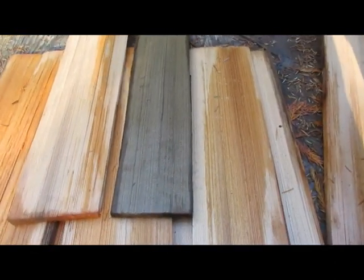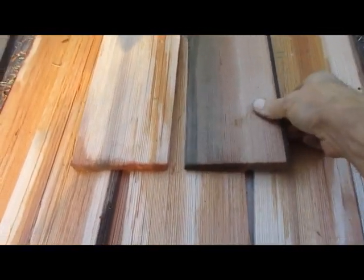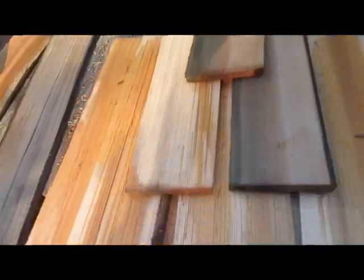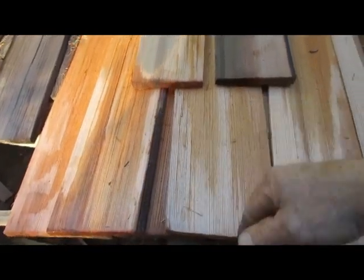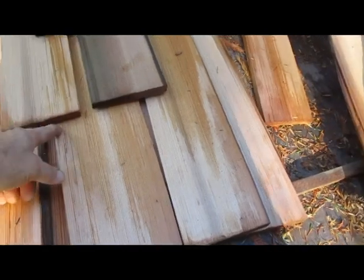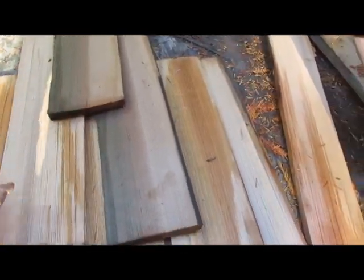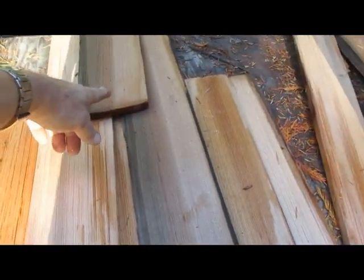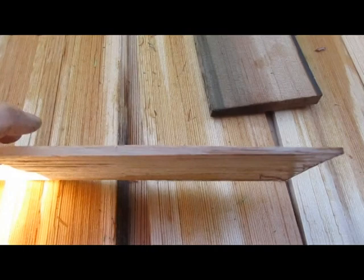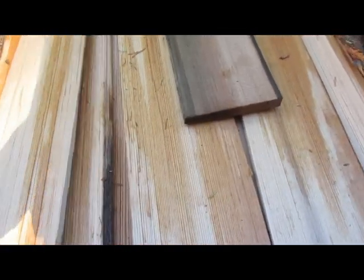When you're working on the roof, your hammer has a little hatchet on the back side and you just whack the shingle to fit. The course exposure is usually nine inches — some people go 10. With a 24-inch shingle at nine and nine, that leaves you six inches of protection up top. If you went 10 and 10 you'd only have four inches of protection, and that's a concern because the shingle is only that thick near the top. I think nine inches is the best way to go.